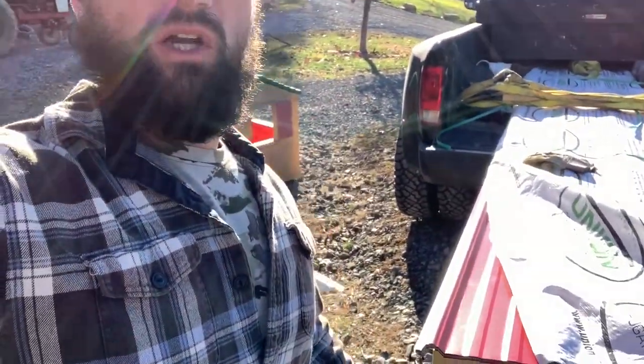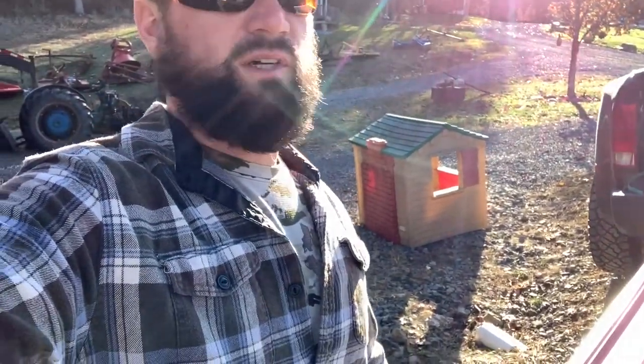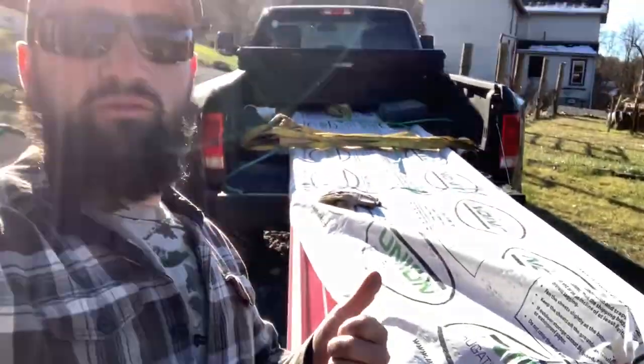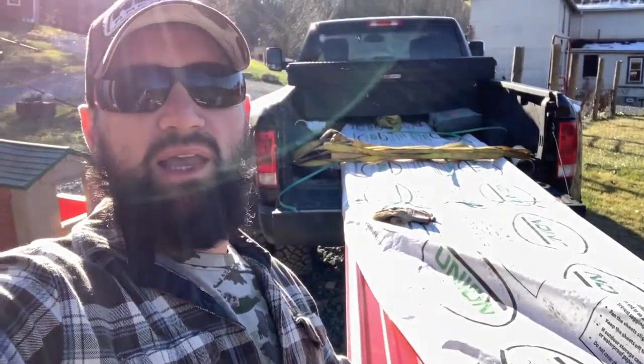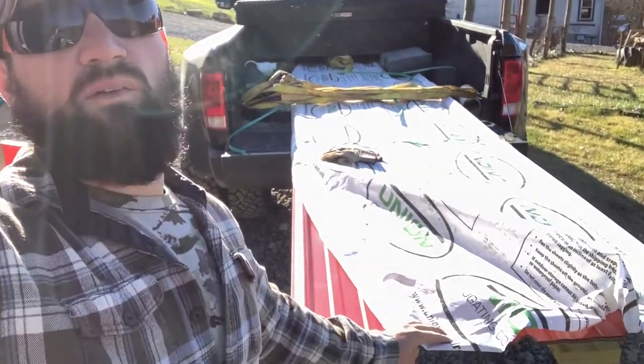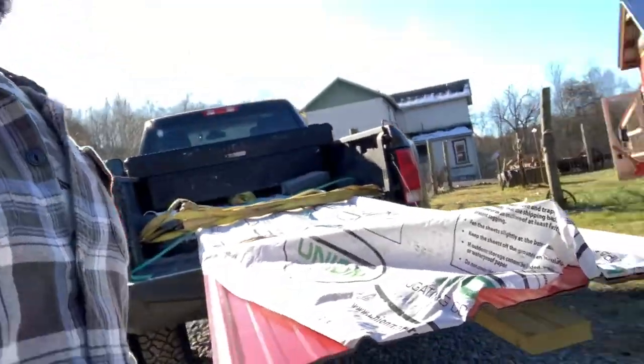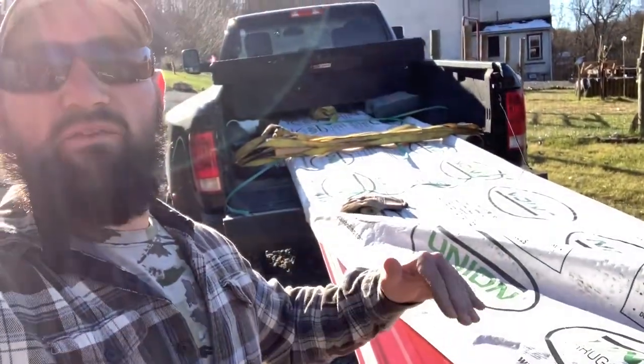Just one thing I wanted to show you guys, if you don't have a trailer, like I have a 30-foot gooseneck and a few other trailers, if you don't have access to something like that, what works well is, remember, if you have an 8-foot pickup truck bed, when you fold the gate down, that's 10 feet. My sheets are 16 foot 6 inches long. I didn't want this metal going like this and bending in half. So when I went to the store, I bought 2 16-foot 2x6s to take some of that flex off that metal roof.